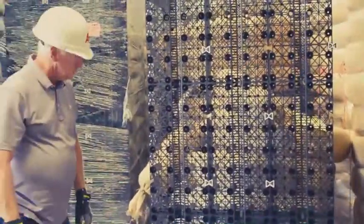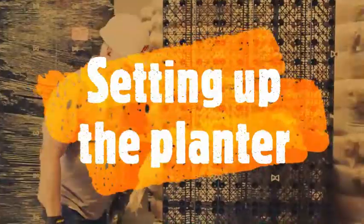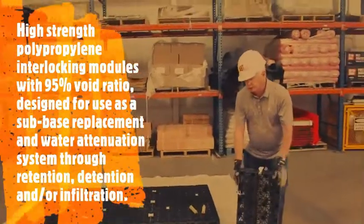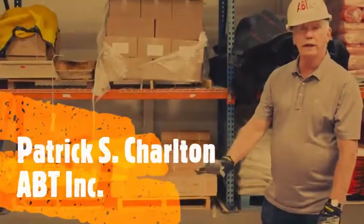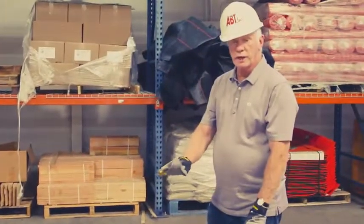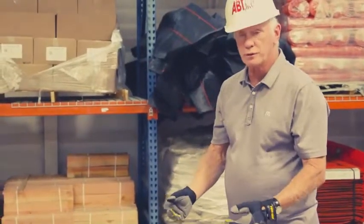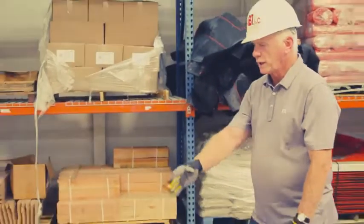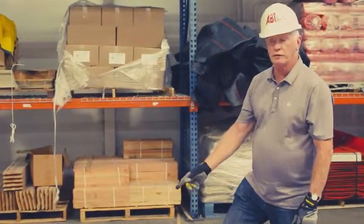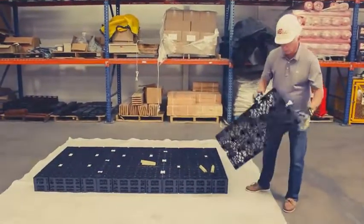That's the way you want to set this up and then put it in the planter. Now we'll move over to setting this up in the planter. The preparation for the planter is you can put settling stone or sand in just to make it even. This is very important for the whole LID process — capture and biofiltration. The wicking fabric is set in, cut to the dimensions of either a single panel of 150 or a double panel. I'll show you how that installs.